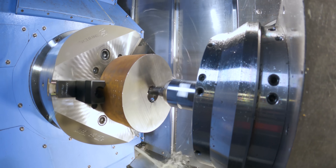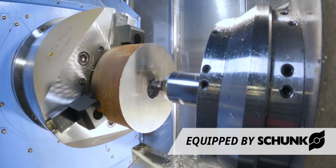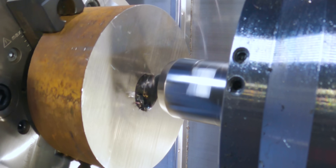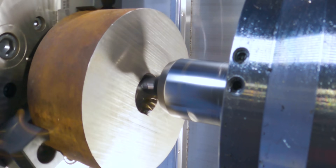Right now I'm doing a helical move at a 10-degree angle until we get down into the bottom of the material. Now the tool is at the final depth — we're one inch deep — and now the C-axis is going to be working together with the milling head to open up the diameter.